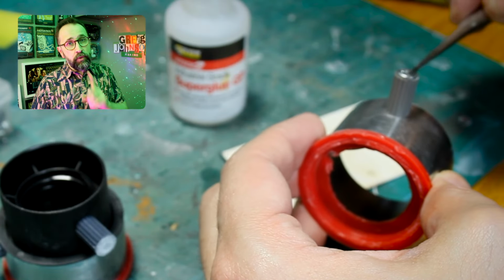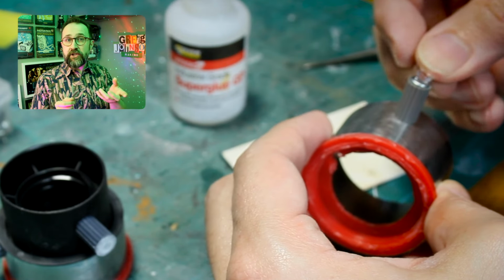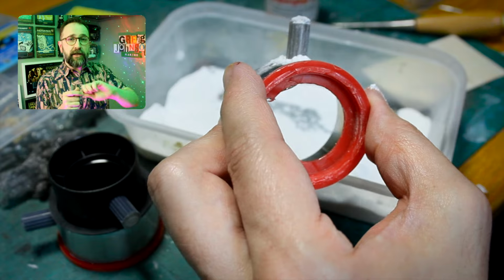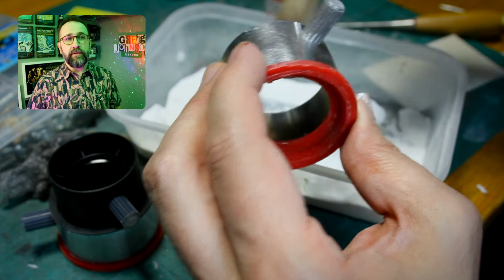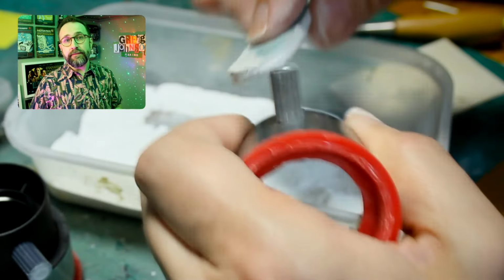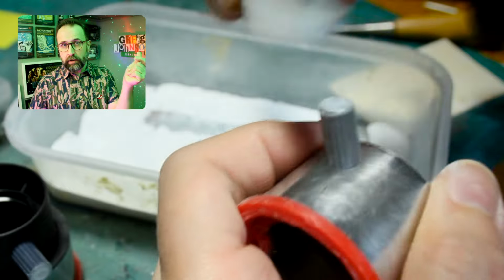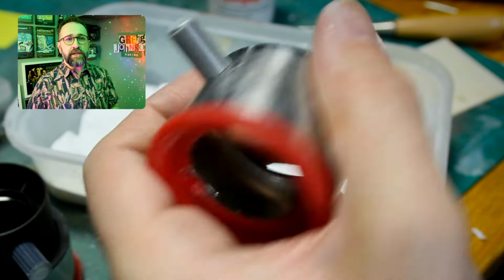Then to cover the wood screw head, quite pleased with this, that's just a dome rhinestone, like a little stick-on diamond bead. Then once that bead is on there, cover the bead with super glue, then you can dip it or sprinkle it with baking soda, and fairly immediately you can sand that, because baking soda sets super glue that quickly. And you've got a nice dome.